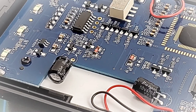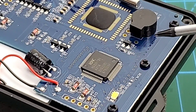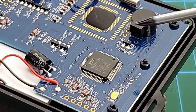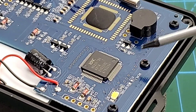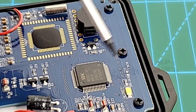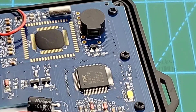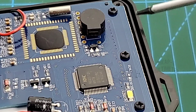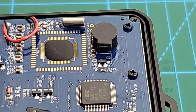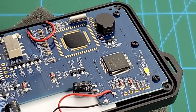This meter does not do current — no current shunt — but we do have one PTC for the voltage side. A couple of Rubycon 10V 470 microfarad electrolytic capacitors — always a good thing. Moving up the board, the main IC is cobbed, and we also have an ARM Cortex processor running up to 48 MHz with 8 KB of RAM — a neat little chip with on-chip peripherals. The NCV is embedded in the PCB itself with no protruding metal filament, which does limit NCV performance. The flashlight LED is really tiny and doesn't give off much luminescence.